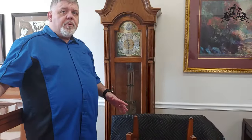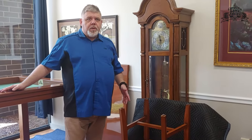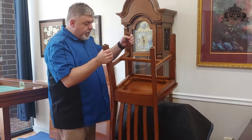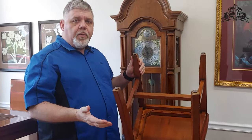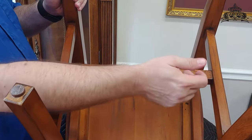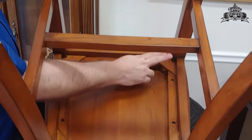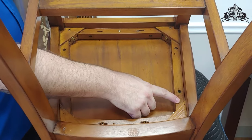Our chairs are made out of the same solid Indonesian mahogany. We do armless chairs because those go best with tables. Though with an armless chair the back might get wobbly without support — we have stretchers between the legs, a stretcher between those stretchers for support, and then we have corner braces and braces between those corner braces for maximum stability.